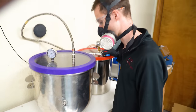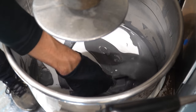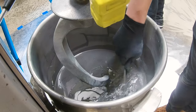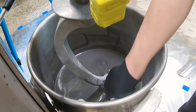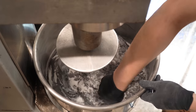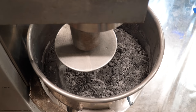After carefully letting the air back in without creating more bubbles, we put the bowl back in the mixer and started adding the ammonium perchlorate in short batches — same reason as the aluminum, we do not want dust or clumps, so we go slowly and carefully. We add it a bit at a time, folding it in, then mixing for a minute or two before adding more. We start with the 200 micron AP, then add the 90 micron AP after, and once the 90 micron is in, we mix for a good long while to create a very homogenous substance.